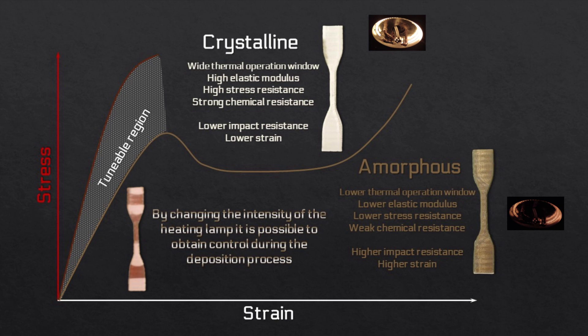Alternating by keeping the sample above and below the glass transition temperature — the best idea is to change the intensity of the halogen heater. As a result of this, you get the desired properties: flexibility or increased stiffness, a ductile part or a part with high elastic modulus. That is your decision now, thanks to the new Dimension 3D.